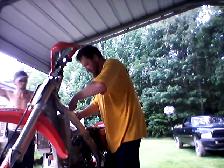Okay, so let me just try 13. If I can get a 13 in there, I'm pushing it over. Then we've got a problem anyway. Means then the valve is good. No, 13 won't go. Did I say 12 would? Yeah, I think you said 12 would barely go. We're going to double check, because you need to measure twice and cut once. Yep. Okay, so that was a 12.